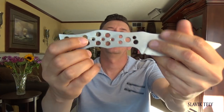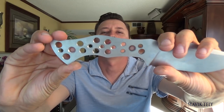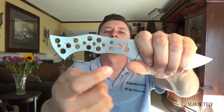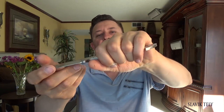There's a question: why do I put holes in my tang? These two are for decorative pins, these two are for decorative pins, and these three are for corby bolts. The rest are just to make the handle lighter and give the glue more surface to attach to. Once you add wood or whatever material, that part becomes heavy, so you kind of want to balance it out.